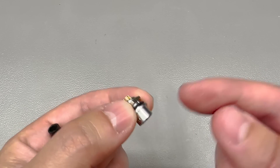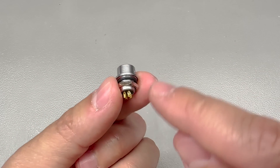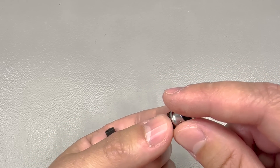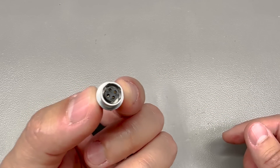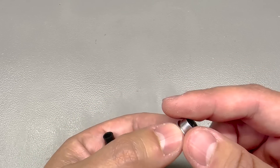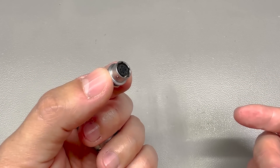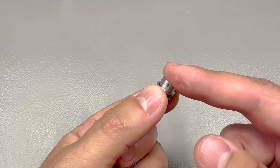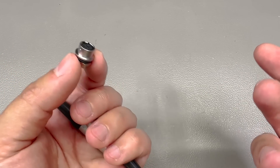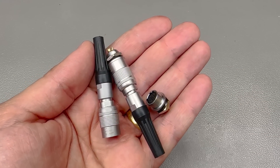You can't solder them directly to a PCB — well, unless you install them vertically, in which case you could solder them to a PCB, but you won't have any mechanical reinforcement. So I think these are great for a panel mount type of wiring scenario. I would love to see a 90-degree right angle version designed for PCB mounting with some mechanical mounting studs from the same manufacturer, but until I find that, you can take a look at these via the link in the description.